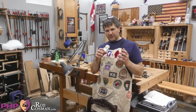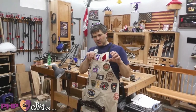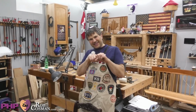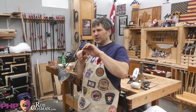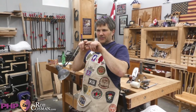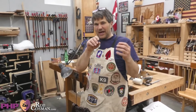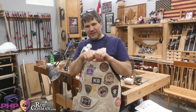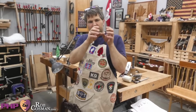So part of the tenon would go into the hole, and that was drilled green. So when they would put it in there, and as the wood would dry, it would shrink and make that very tight. And seems to me, I remember reading somewhere that they would actually turn a bit of a ball, not a ball, but a bit of a bump on the end of the tenon. So the tenon would go in, and it would be larger at the front than at the back, but because the wood was green, it was almost pliable. And they would force that tenon in, and then as the chair legs dried, they would dry around that bulbous bulb.